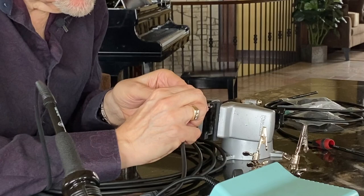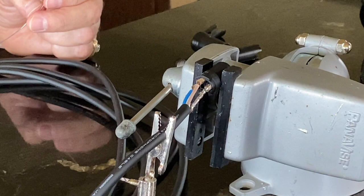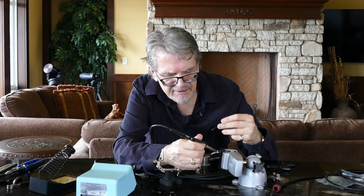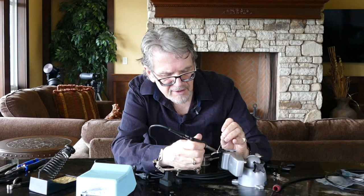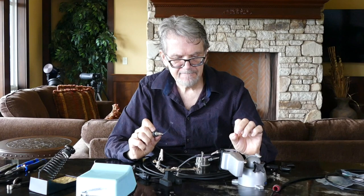What we're going to do is start by making sure we get the ground wire in the right place. I pushed it into that little slot and I'm going to use my third hand just to hold that wire and keep it in there — just clamp it down while I apply solder to it. They're all seated into the connector, ready for solder to be applied. I'm going to start with the ground connection, hold the soldering iron on the conductor until it generates some heat, and then apply solder to the connection where the soldering iron is touching. It's very easy to see when the solder starts flowing into the connector and the wire. They're both heated up and are now one in the same.